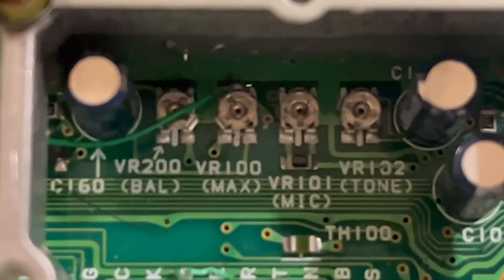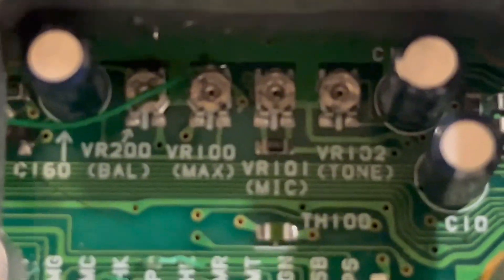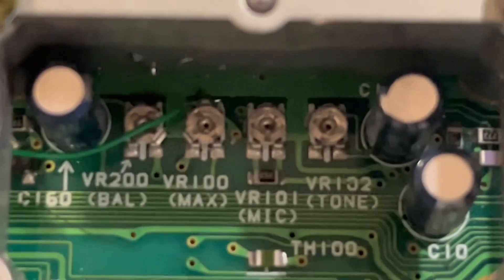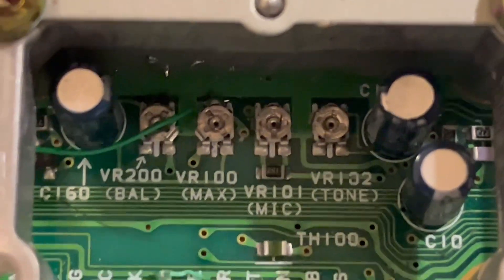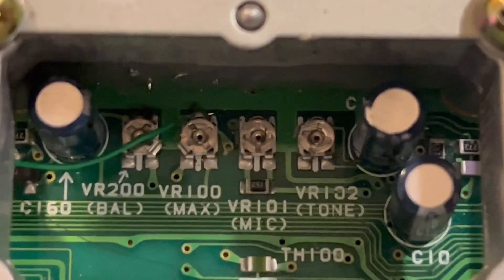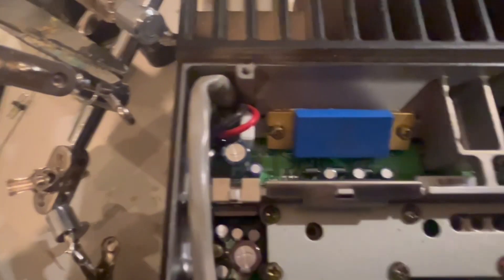This is the modulation set pot, and because the voltage needed is pretty high, we set the modulation to the output to give us the max volume for that MMDVM board. I just have that going out directly via cable to the rear of the radio, replacing the mic input with that.